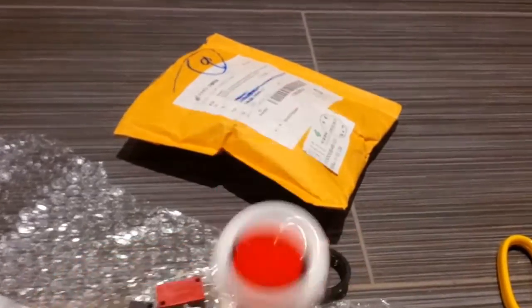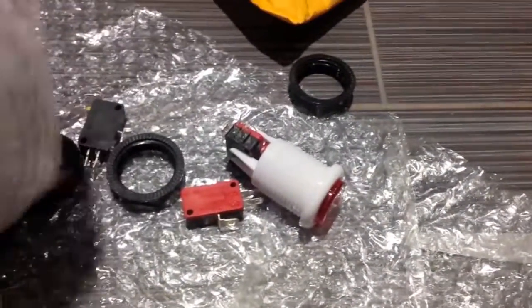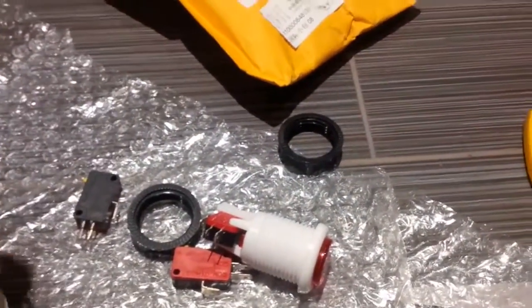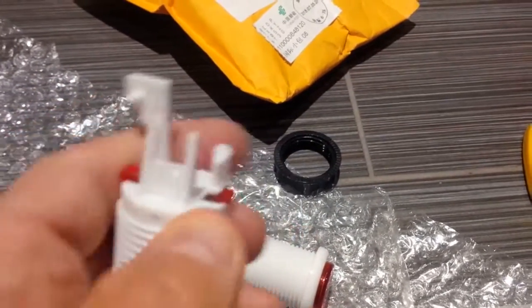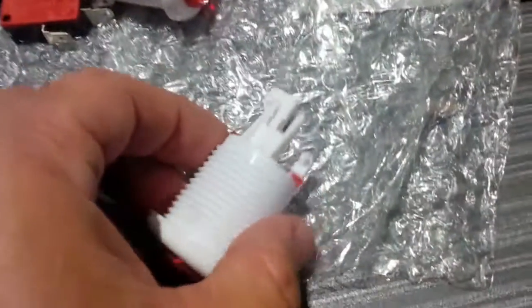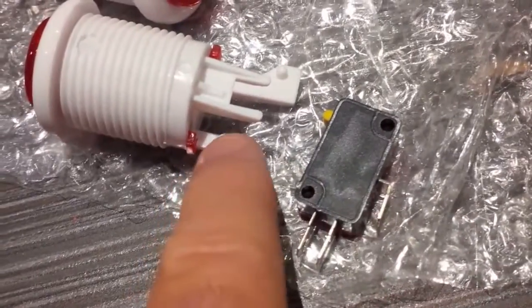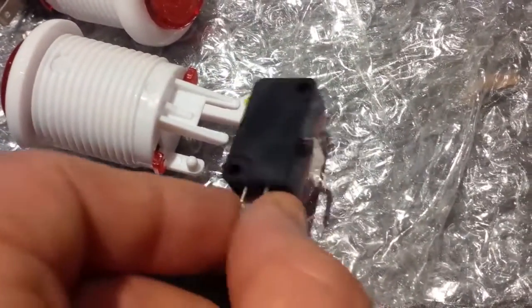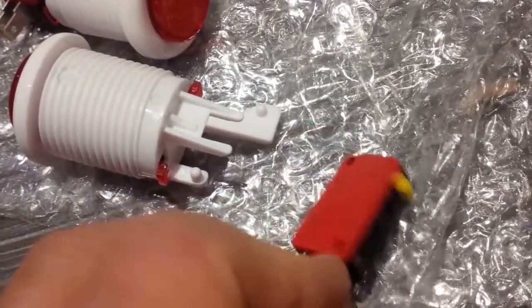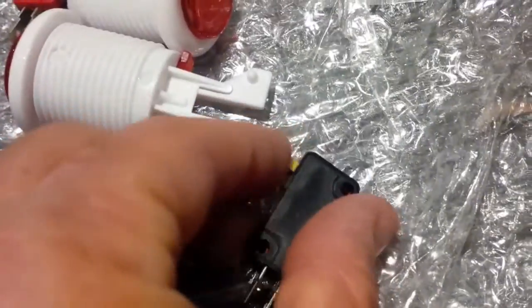Just a little add-on: I figured out how these micro switches get inserted into the buttons. There are essentially two holes in the micro switch — one here and here. And you'll notice that inside one of these buttons, there are also two little dips — one there and one there. Those two little pins that come out of there line up with the micro switch, which would be inserted like this. That hole there lines up with this dot, and that hole there lines up with this. When this slides in and you fish it in and get these tabs to flip and fall into the holes on the red side, that red part will be in contact with this micro switch and click it in and out.